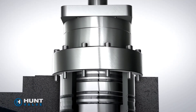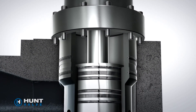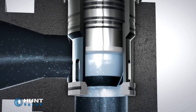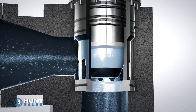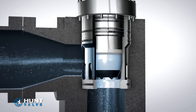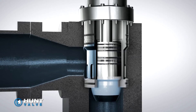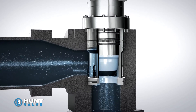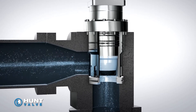The proportional poppet valve's electromechanical linear actuator avoids the maintenance and reliability issues associated with water contamination in the hydraulic media because it is not a wetted part and is totally isolated from the descale water. And since it's an electrical actuator, it eliminates the moisture and contamination problems associated with pneumatic actuation.